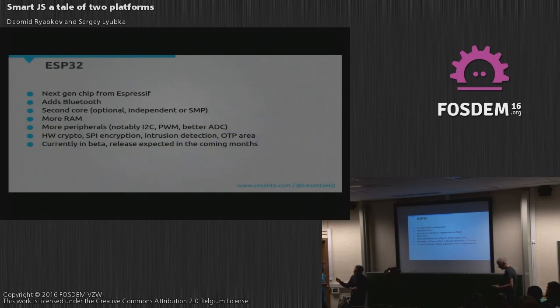I was wondering what's the actual limit for the amount of flash attached to the ESP8266, because now we have flash chips with 16 MB or 64 MB. There is a limit on the size of the code window you can map. I didn't work with that in particular, but I heard it's a 1 MB window. But you can access flash via SPI for data, beyond that, so there's no problem. Although I personally have not attached flash larger than 4 MB.